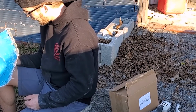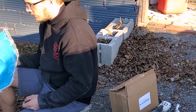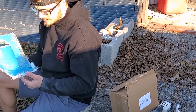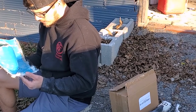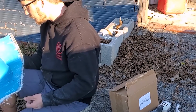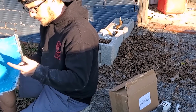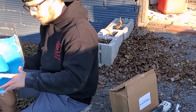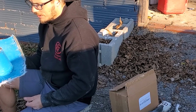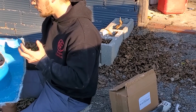Once again, I think there's several issues. This one I did not have rollers for because my rollers broke or messed up before I got to this, or when I was getting to this. So the lamination isn't great, but the strength is there. There's just a lot of defects, and the gel coat like that is still wet. Where it actually cured is pretty good, and I think we could use it, but where it's wet, obviously, is not very good. But yeah, I'm thinking that this stuff needs to just be thicker, because where it was thicker, it dried all the way.